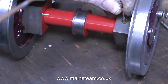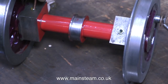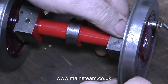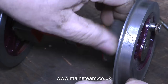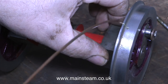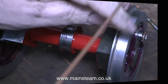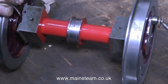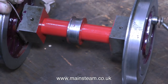To be perfectly honest, I made a mistake with the chronological order of assembly here. Initially I fitted the pump and the eccentric to the axle, and then tried to feed everything into place, but it didn't work that way. There'll be more about this in the next video. What I'm currently doing is oiling the axle boxes — I just missed my target there. It's very important to make sure that all the oil ways are clear and not blocked with paint or grime, and luckily these are okay.